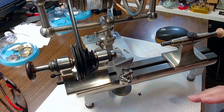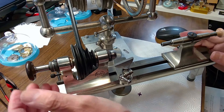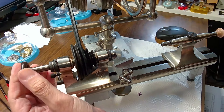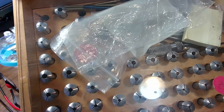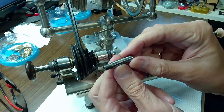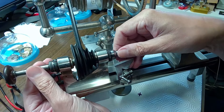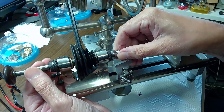This is the draw-in spindle for the lathe, and your lathe chuck screws into that spindle on this side. The spindle goes in this way, and when the chuck goes in it locks. You need to get yourself a set of chucks that cover all ranges for doing work. The chuck actually has a groove in it right here and that groove aligns with a groove inside the spindle.